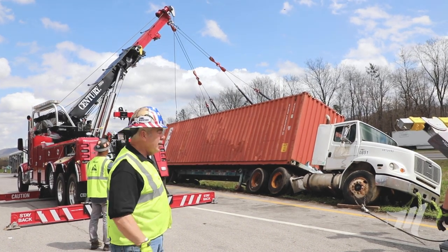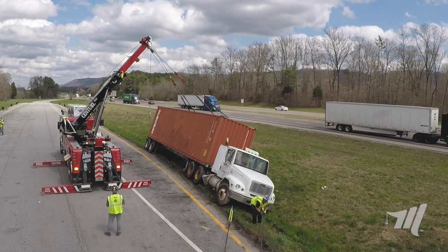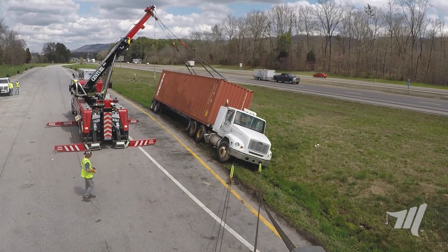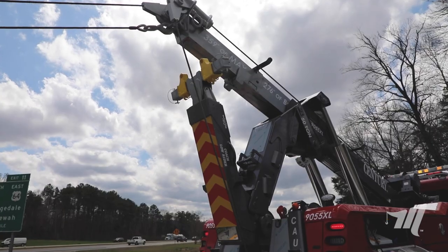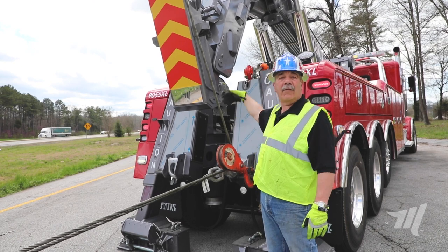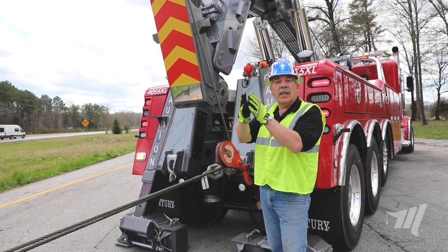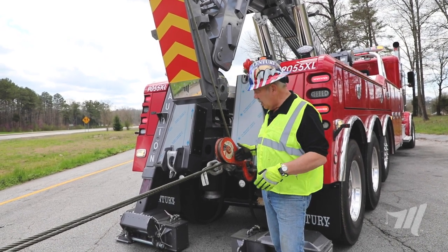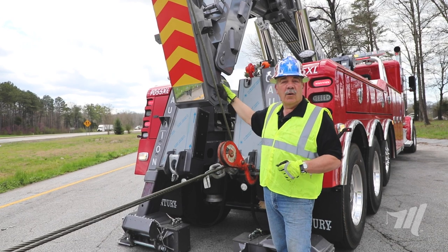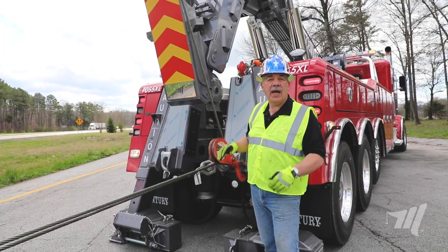At this point we're going to stop — it's uprighted right now and secured. We're going to take the 90-55, unhook the wire rope, attach to the front wheel, and reposition the truck. With the 90-55 we're going to do a pick and pull. The high line picks the low side of the tractor trailer that's in the ditch, and the pull line comes down to the D-ring, goes out and comes back again. The boom is out of the cradle and high enough that there's no support side to side. By running the line high and back to the end of the boom, we technically tweak the boom. But by running it down to the D-ring and out, we neutralize the boom so there's no fatigue on the boom if it's winching off to the side a little bit. As you get them out of the cradle, neutralize the boom so you're not pulling to the side — very important.